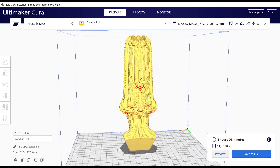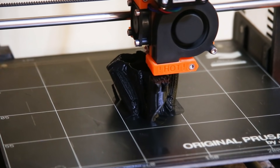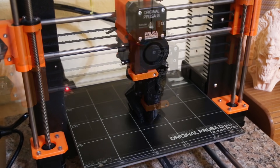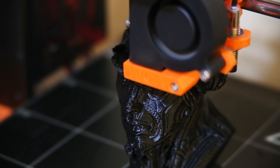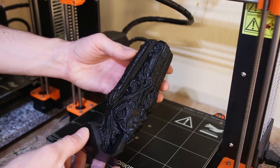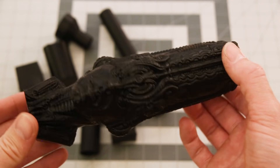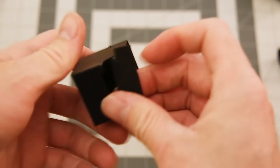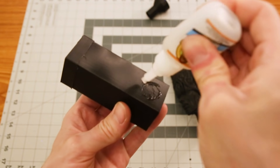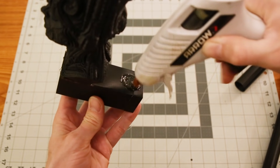This model is called The Conduit by artist Zane Rogers. Along with the model I also printed some tubes to use as a sprue and vent. If you would like to print this model yourself you can find a link in the description. After everything was done printing I went to work gluing the pieces together. It's best to fill the shell with metal from the bottom to the top — this way as the plastic is melted it floats to the top and out the vent.